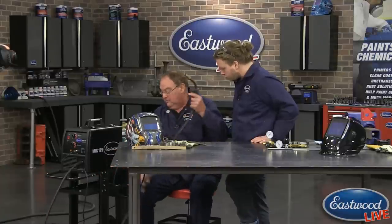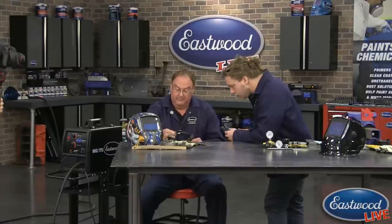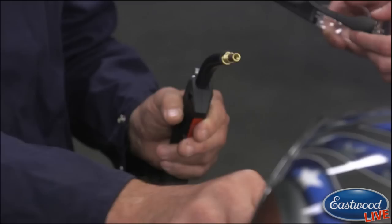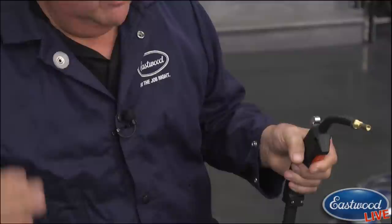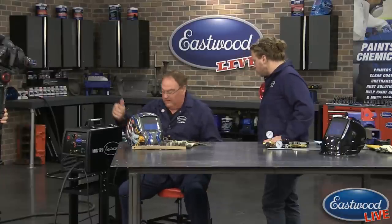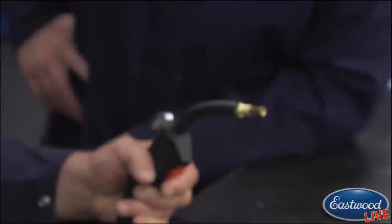The very first time you run wire through, I take off the nozzle and the tip so the wire is allowed to come through without hitting the tip at all. When you weld and feed through, make sure the torch cable isn't kinked — you want a nice, lazy loop in there as straight as possible so the wire feeds smooth. Our gas is off because we're just feeding wire. Turn the machine on. Now remember — this wire coming out is live, it's hot, so don't touch it.